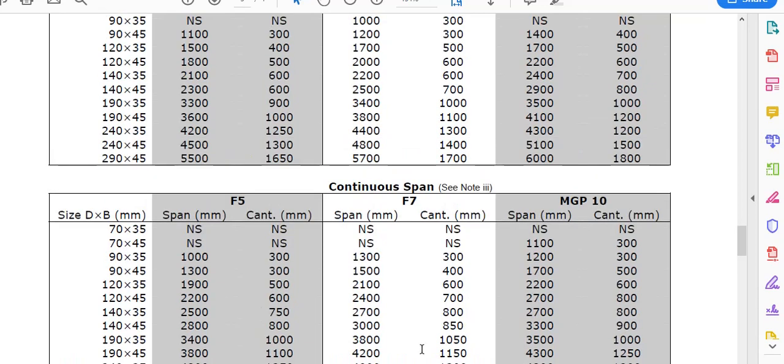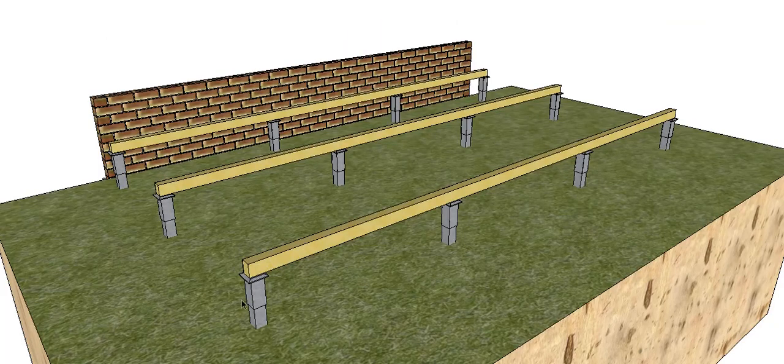As I said, I want to keep my piers pretty much the same, so I'm going to run with a 1.5m span. You can lessen that to suit the width of your deck — it doesn't really matter. You pick the timber that you think is the most economical for your actual situation.